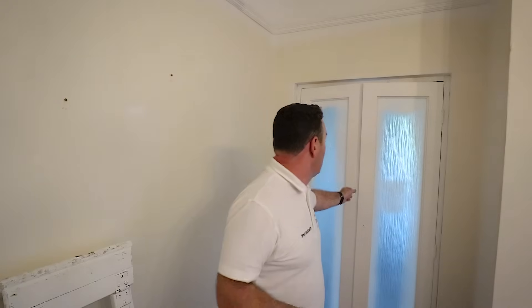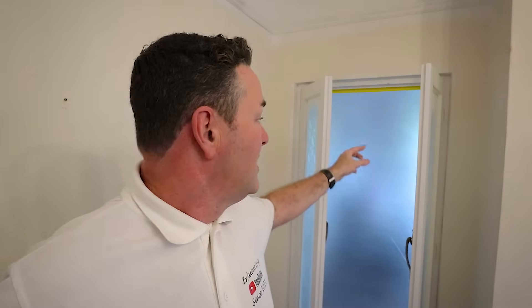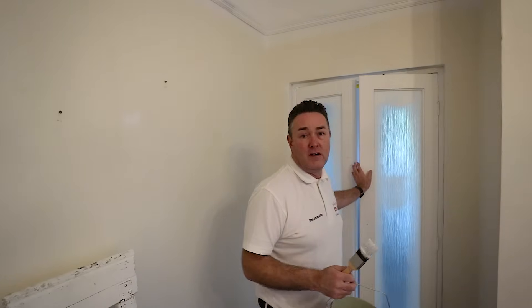In time I will be doing that room in there, so where I would normally say you paint that edge because it's the opening door — that part of the door frame because it shuts against it — I've actually done all the frame with that primer because I know I'll be doing the same sort of system in there. I've rubbed them down and coated it all up at the same time. So you can do that if you know what you're doing in the next room and you're coming back to do it. This being an adhesion primer, a stain blocker, and also a knot blocker will stand me in good stead for the subsequent coats.